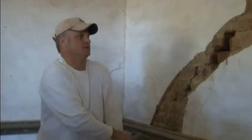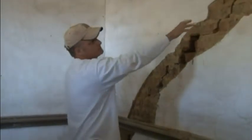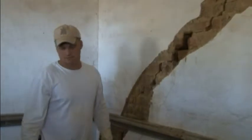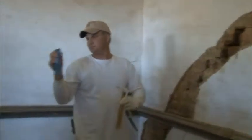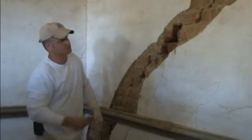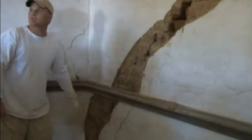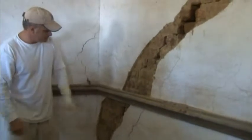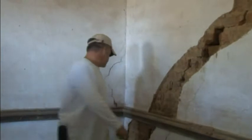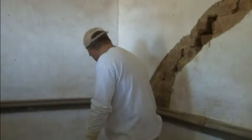To go over it again — one of the main things you start off doing is exposing what you're going after. In this case, we're trying to expose this crack. Using really basic tools — a hammer, a little chisel, a knife — you score your plaster and just expose your crack. If you find plaster that's not sound, take it off because you'll have to remove it for your plaster repair anyway. In doing that, we kind of exposed more cracking that wasn't really evident. You can see it followed the bond nicely here and we got into fractures where some of the bricks were actually broken.